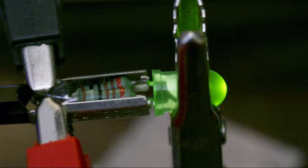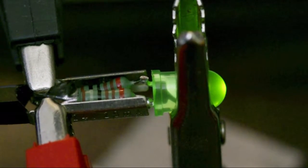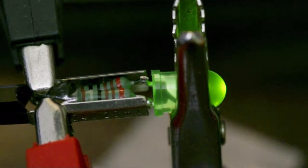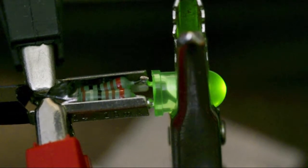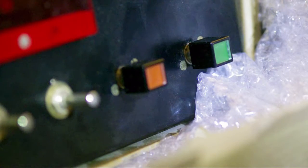That's lighting up. Killing the overhead lights should make it easier to see, but that's a little less than 20 volts. Might be a little dull, I suppose. But shorting out one of the 1K resistors should take care of that if I needed to. Okay, since the last cut, I decided to replace the green one with another super bright. I went ahead and did this orange one, as a super bright yellow LED. I didn't have an orange one around, but I think it came out pretty well considering.